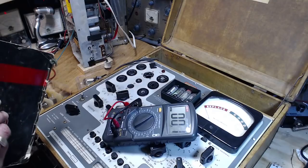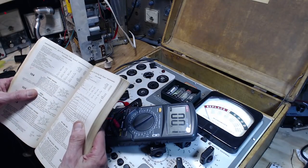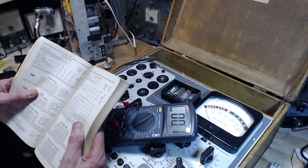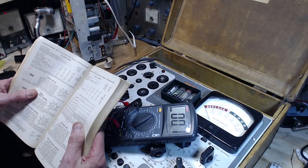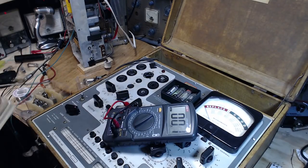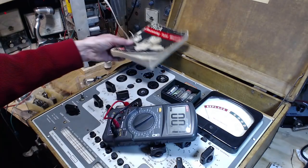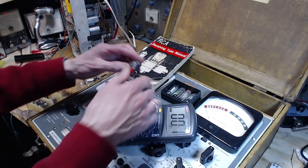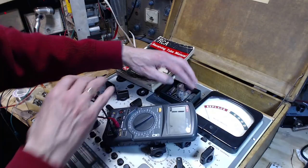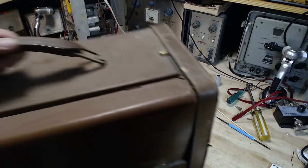Okay, so 1S4 then, if I was testing it thinking it was something else, I would have got a short circuit between 5 and 1. I didn't see that. So yeah, so those are 3V4s. This is a 1S4. Out the door. Okay, I gotta go dig up that radio and see if we can find some tubes in it. Okay, how about this?